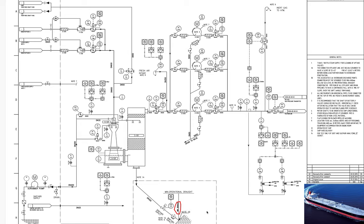I also like to share my experience in dry docking — it's really really important when you're going into dry docking and if there are any repairs for the IGS system. Before you start, you should get a good photographic library so that if there are any kind of modifications, you'll be able to trace any parts that were removed or changed position. This is really really important.